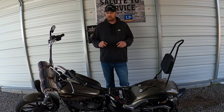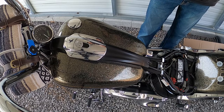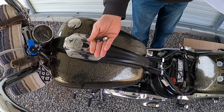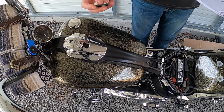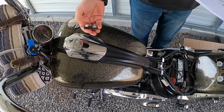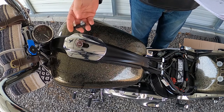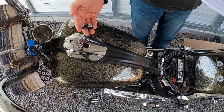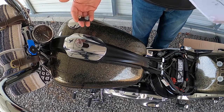I'm going to reposition my camera and we're going to start. Here are the specs of the bracket — it is about five-eighths to half an inch wide, and one and three-quarters inches in length. From the edge of this bolt to the center of the plate is about three and three-eighths of an inch on each side. The holes are one inch from center to center. As long as your holes are one inch and you have play with this size, everything will line up and sit perfect.